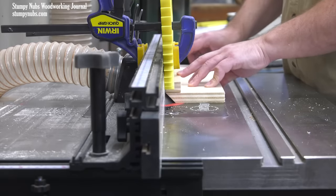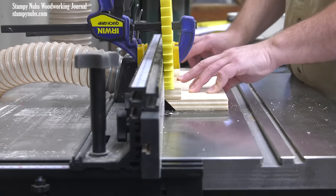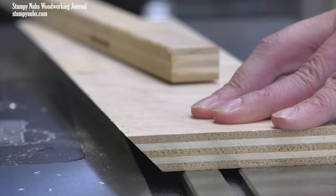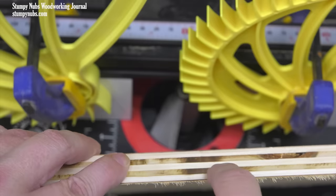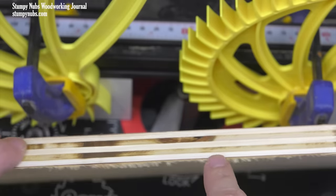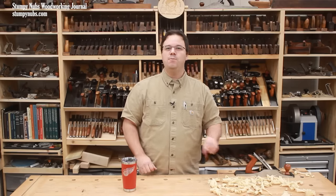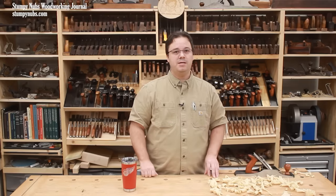On the other hand, if I employ the second method by applying a guide strip above the workpiece, it will help support those delicate fibers beneath it even if I do cut away the entire edge. This type of tear out is mostly an issue when cutting across the grain of veneered plywood or with some really chip-out prone hardwoods. You may not have to be so careful on most solid woods, but keep these tips in mind just in case.